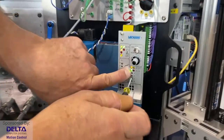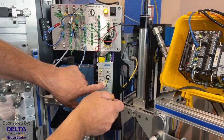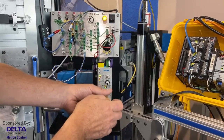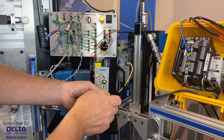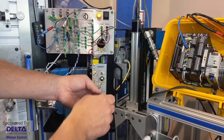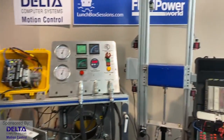So we were able to achieve position because with our cylinder passing that mass through our set point, there were times when it matched up and it just canceled the valve and it did arrive in position. And I'm going to keep turning down our proportional gain here quite far. And at times we might even find out that green lamp goes out here. But let's see what happens as we instruct our cylinder to move. So here I am now asking the cylinder to extend. Let's see what happens here.